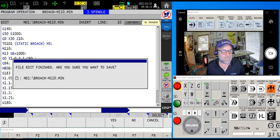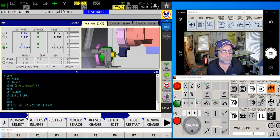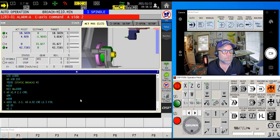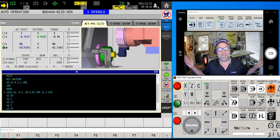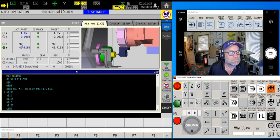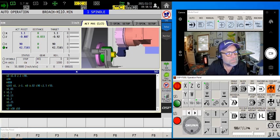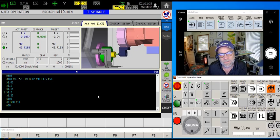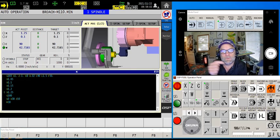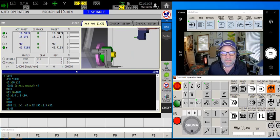Now with C90 added, after selecting and quitting you can see the C-axis is at 90 — Charlie did his homework. As I step out with each subsequent X pass, everybody's happy. Once again, to beat a dead horse: if I don't want to peck at each pass and just want the shaper action, just make D larger than the total travel of the feature.